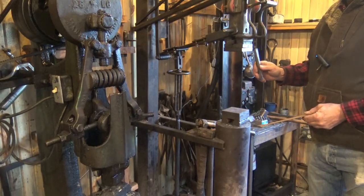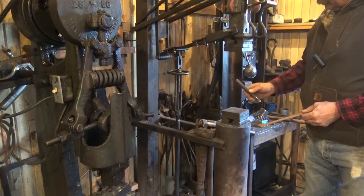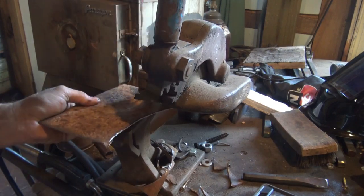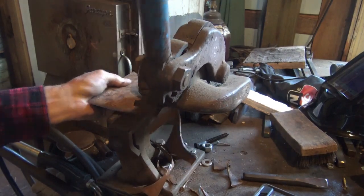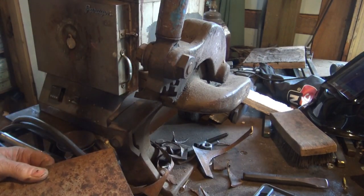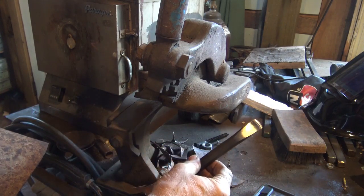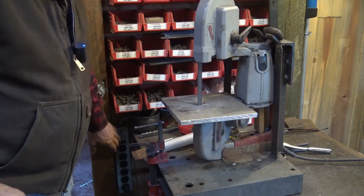Make sure you have a chain stop or some other positive stop so that the head can't come down if the chisel kicks out — you don't want to squish your hand. We can cut this on a Beverly shear very fast, and this is the way I typically do them because I have the Beverly shear and it will follow a curve. But again, that's a fairly expensive tool that you don't need to go buy just to do one or two.